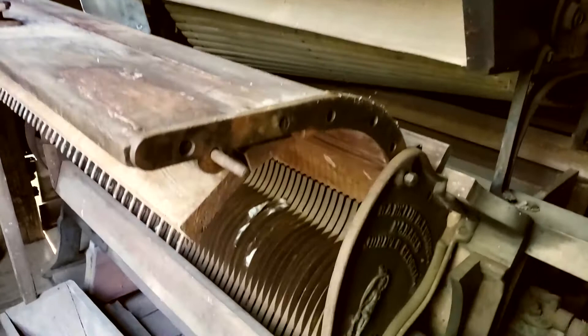The cotton makes its way from the feeder down into the cotton gin stand. The cotton lint then catches on the teeth of small saw blades and is pulled through holes too small for the seeds to fit through. The seeds then fall through the hole in the floor here and are collected below. The cotton lint then moves its way through, is fluffed, and then sent over into the condenser for the final part of the processing.